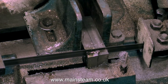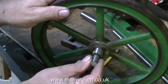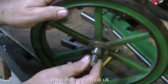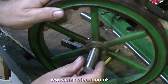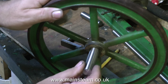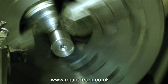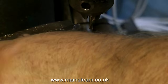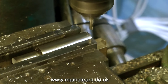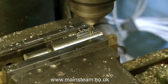Starting with cutting the pieces to length. Time now to check some tolerances. This is the original piece of crankshaft, and here I'm trying it in the flywheel — it's a very sloppy fit. This is the new piece of 3/4 inch diameter silver steel, and this seems to be a slightly better fit. In this clip I'm drilling a centre hole in the crankshaft using a centre drill — more about this later. Now over to the milling machine, where I'm using an original piece of the crankshaft, the broken part, just to make sure that the milling cutter is in the centre.